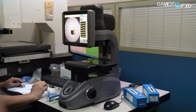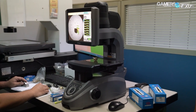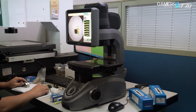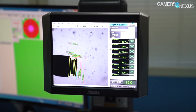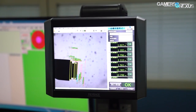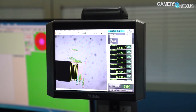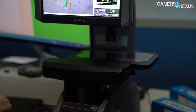Another station in this room is for optical inspection of components against known measurements from the engineers. The microscope is hooked up to a backlight and a computer, with CAD files loaded to establish known guidelines for acceptable variants in manufacturing. The equipment is used for both quality control testing and for pre-production planning, and it's only partially automated. The computer detects the outline in the product's silhouette, under the magnifying glass and on top of the lightbox, and then optically measures the dimensions of the product without much human input.